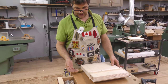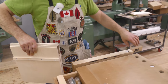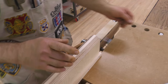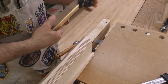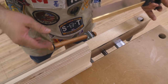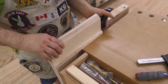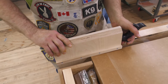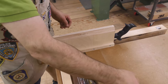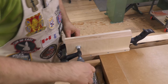I have a Scandinavian shoulder vise, which gives me unobstructed area between the jaws, so I just slide it in there. You can also do that with a Moxon vise. If you have more of a traditional vise, if you've got extended jaws, you can still do it. Simply put your saw into place, get your proper exposure. And when you clamp it, you're only going to be squeezing one half. So if you can come in here with another clamp, just put a little bit of pressure on the side and you're good to go.